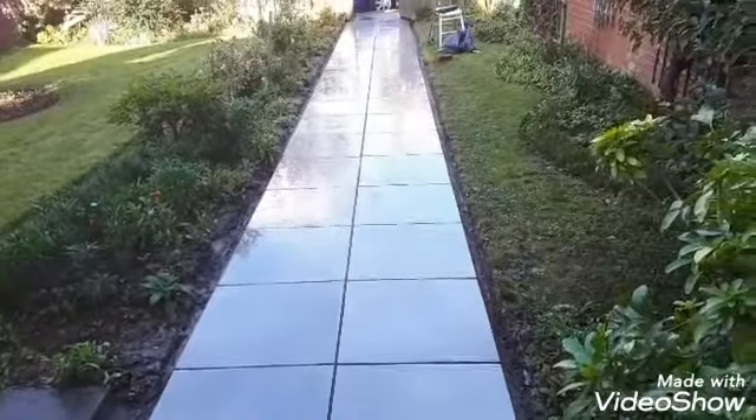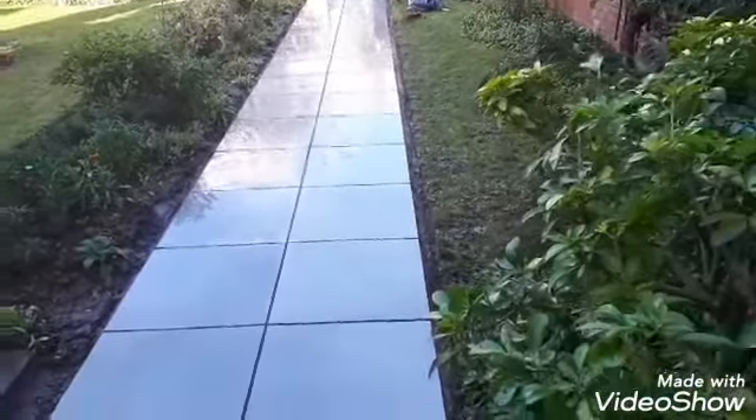There you go — all the joints filled in. One of the final tests on any slabs or tiles is the reflection when they're wet. If the reflection is not breaking up — so basically your neighbour's chimney reflection runs in the same line over the different tiles — that means the tiles are laid in a single line, so they're all even. The door frame reflection runs nice and straight.